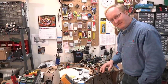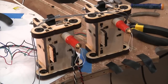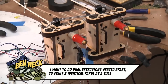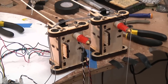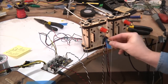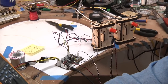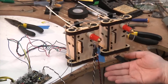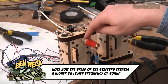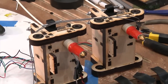Now let's do a dual extrusion test. I've got both extruders connected to the board and I'm going to test extrusion. I increased the current on that particular stepper driver so it could handle two motors, and it seems to be working out. I'm going to try at a slightly higher speed — probably faster than it would ever actually extrude, but good to test. The extruders need a little more reinforcement here because they move a bit when extrusion comes through, but I'll shore those up. Looks like dual extrusion has a chance of working!